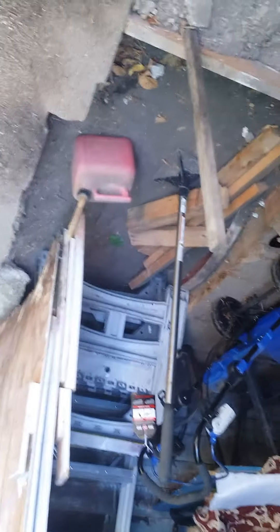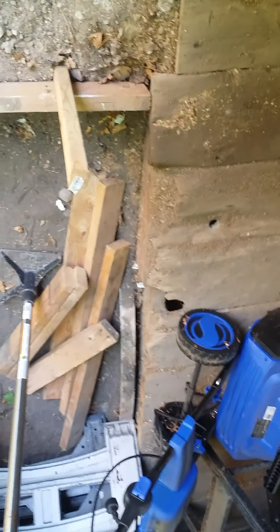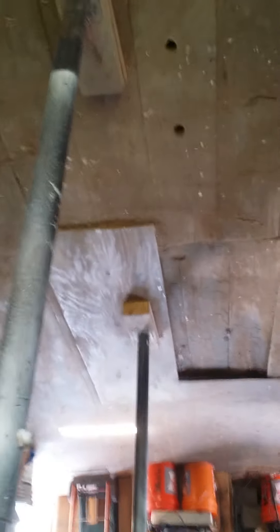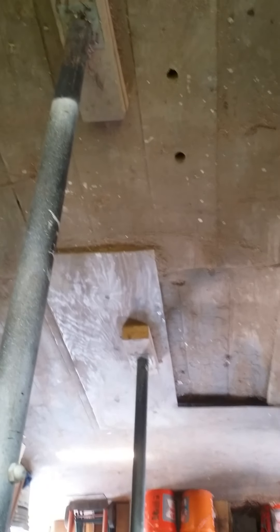When he gets to the edges he'll start mending these sections together — he'll continue with what I did here, pouring concrete in and digging out. Same thing along there. Right on this spot, where that floor rafter is, he'll cut back and tie it in. We'll put new floorboards over it — he's really just putting a footer right here and then new treated lumber going over there. We may do that bit by bit. Wherever he takes out the posts and puts the concrete in, we'll fill that up.